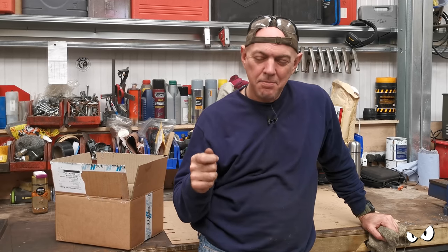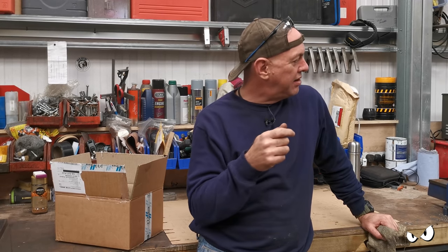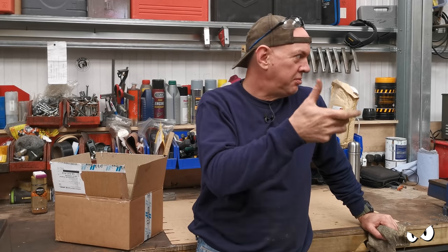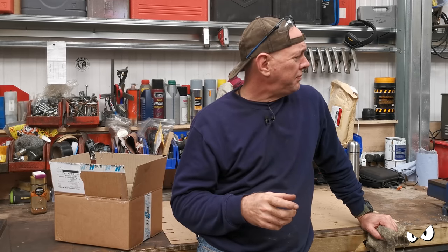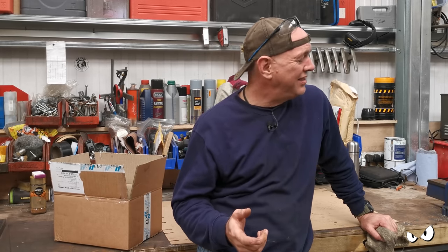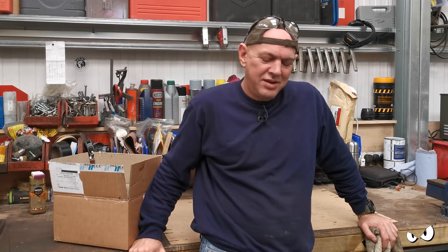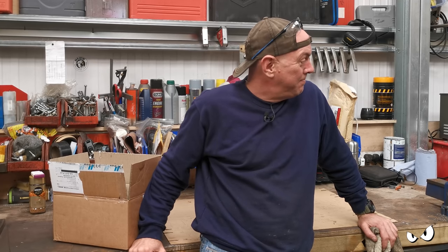I think bits of it are a little bit fiddly to move, like the thread cutting gearbox. You have to drop the handle all the way to then move it, to then bring it back up, because obviously you're disengaging the gears at the top. It's not the smoothest of operations, but it works. I don't care. The machine's 1963. He's an old bird. Well, actually, it's not a bird, it's a bloke. Does man things, not girly things. But yeah, everything works a treat.